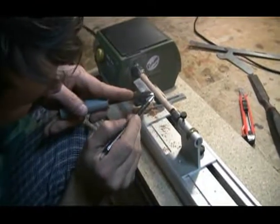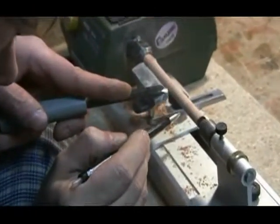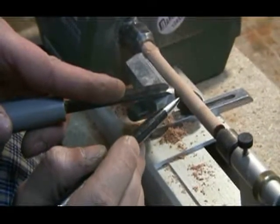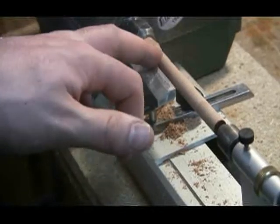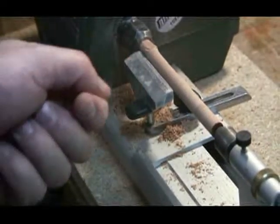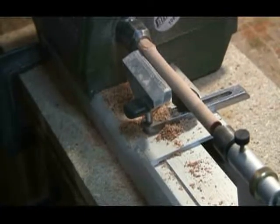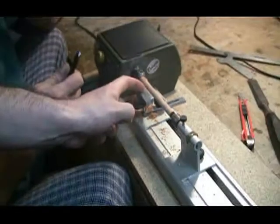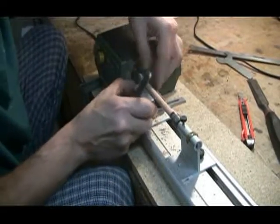Okay. I took over here, central line. And I've taken off too much wood on that section there. That's because I've applied too much pressure inwards. The reason for that was the way I was seated, and I naturally wanted to push inwards when I was bringing this back. I also found that got in my way a bit. So you might just want to take note of that.